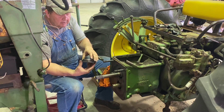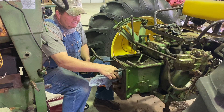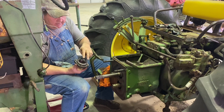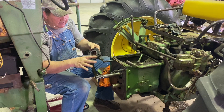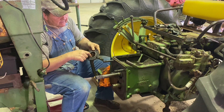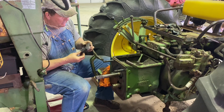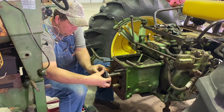So stay tuned and we'll see what we get into. I've wiped everything off of the shaft. I've already cleaned the front mounting surface and I'm not even putting any lubricant in because this will be coming back off. I did have a bad needle bearing which is actually the carrier bearing for the PTO input drive gear. So I've got that out. I don't have any seals or anything that is going to interfere with us checking what this end play might be. So I'm going to put this right back in here.